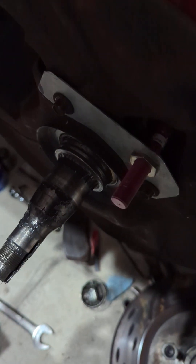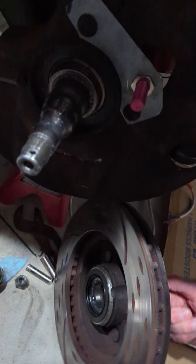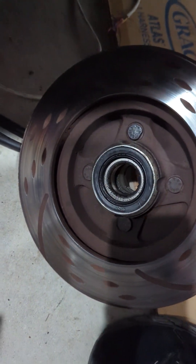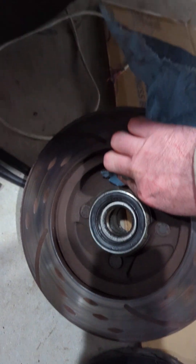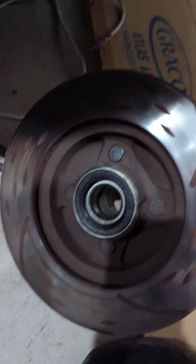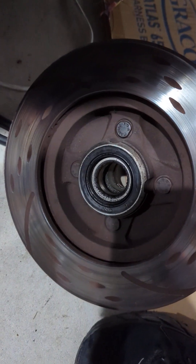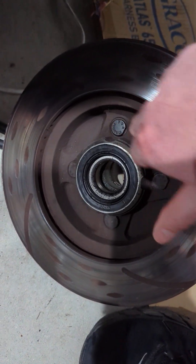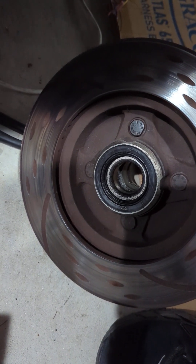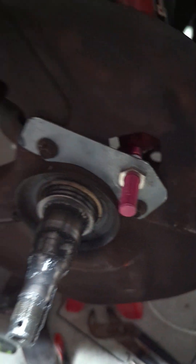Here you'll see how it goes, and back of the lugs. When I set it up, the recommended distance — I can't remember exactly what it was, but it was like 50 to 65 thousandths, which is about the thickness of a dime. So I just took some grease, put it on the back of one of the lugs, stuck a dime on there, spun it around to where it just barely knocked it off, and adjusted it out.